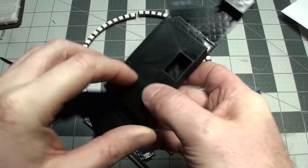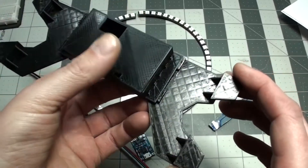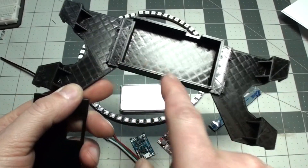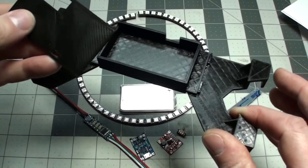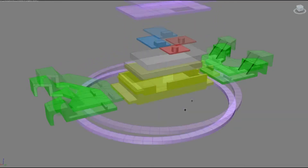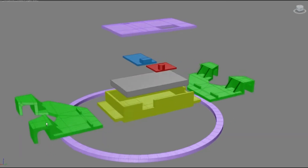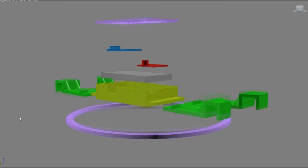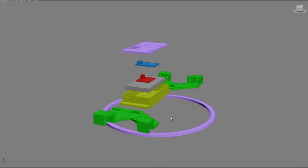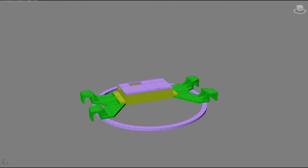Let's go over the control box with the mounts. I don't have that big a 3D printer so I can only print 100mm square. That is why it is kind of busted up into three pieces here — these all three printed at separate times. And then the lid goes on top. So basically all of these parts are going to fit in here. We are going to have the battery sitting in here like this, this little lithium charger sitting like this, our little boost converter here. It is going to kick it up to 5 volts. The control board is going to sit like this, the switch is going to go right over there, and then the lid is going to cap this whole project off. So you can see here we will have the buttons, the switch, and access to the USB charger.